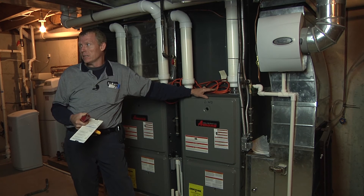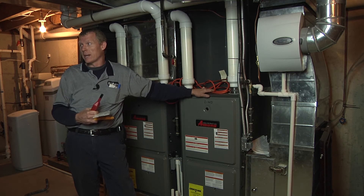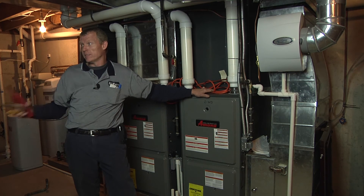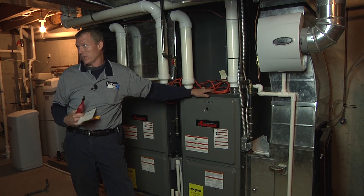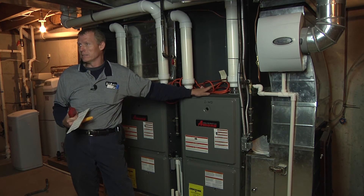With a lot of humidity, you know, you get a complaint: a year ago when it was 90 degrees it worked and there was no issue, but this year it doesn't work and can't keep up — can't cool the house down. Got to look a little bit closer and slower at it. To be determined. So if it's a diminished capacity, you've got to bring up those coils and the air filter.